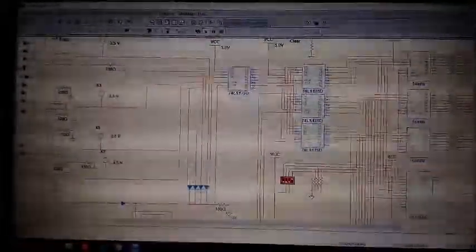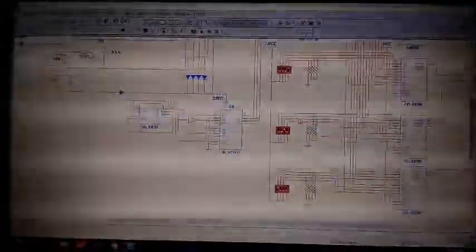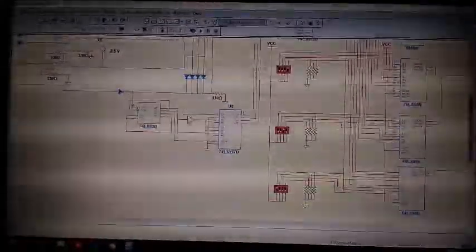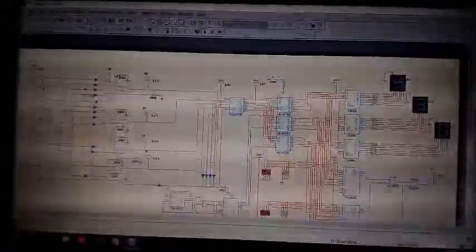To have the sequence of which is being saved first, only one clock of the three flip-flops is active. This is accomplished by using three multiplexers. We could use a JK flip-flop, but it is currently unavailable. The multiplexer's output dictates which clock of the D flip-flop is active.